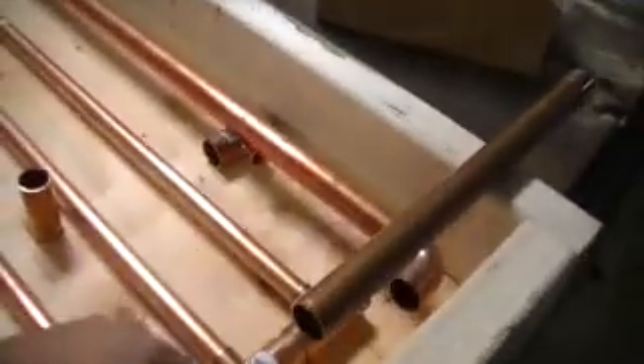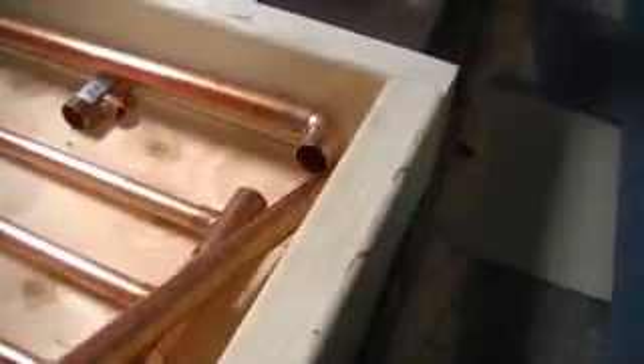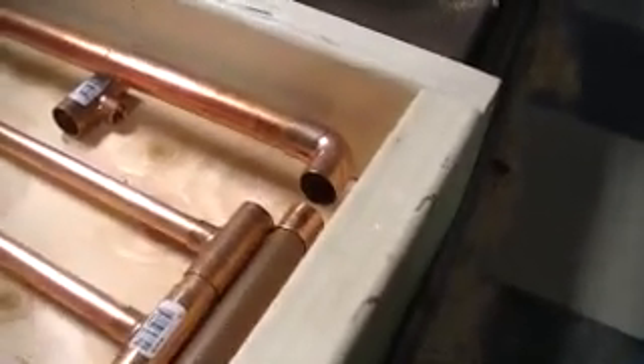There's room for one three-quarter-inch hot water return coming inside. The reason this is sitting up on here is when I put this together, this is going to be soldered in here — it'll be a continuation of this bottom manifold — and it's going to go through the wall. So if I keep all these the same size they're going to run into each other, so when I solder to this one, this pipe at that end I'm going to have raised up a little bit so it'll clear this manifold, go underneath it and out, and be prepared to go to the next manifold.